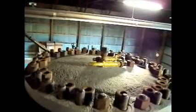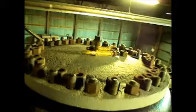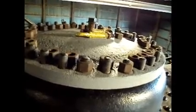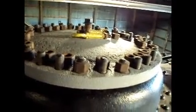And I guess this valve up here, he was saying that's how they let the air out when they get under steam. They crack the throttle, and that's supposed to push the air out of it so that there's not a big air bubble that gets into the dry pipe and gets into your pistons. So that's how they do that.